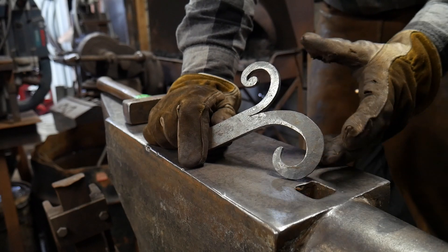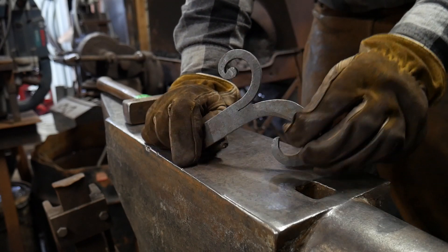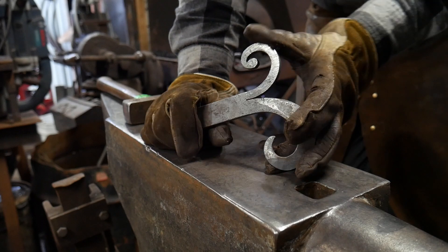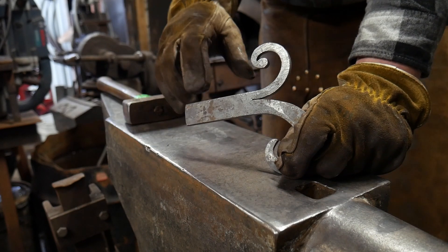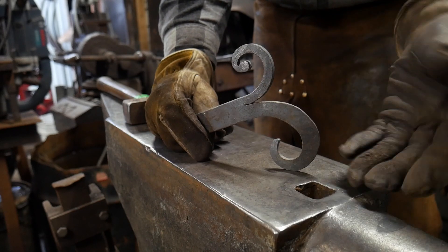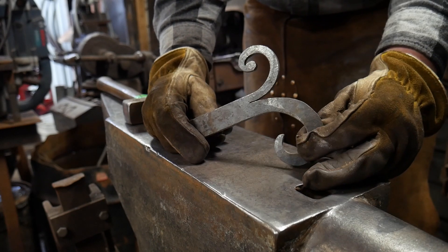This question came up because I had mentioned that this would be good for a hinge or something of that nature. If this thing had been pinned in as a hinge and it was load-bearing, a spot like this could run a crack up the piece or somehow stress out the material, and therefore fail the hinge — causing the door to drop to its sudden demise.